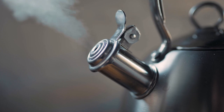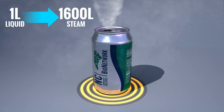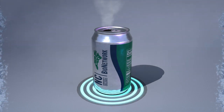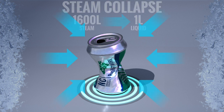When water boils it turns into steam. Steam has a much larger volume than water, so one liter of water can produce 1600 liters of steam. That expansion generates a lot of pressure. The reverse is also true — if you have a system pressurized with 1600 liters of steam and suddenly the temperature drops, the steam condenses back into water. That's called a steam collapse: 1600 liters becomes one liter, creating a vacuum.